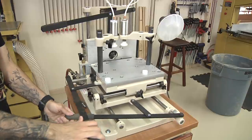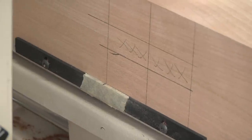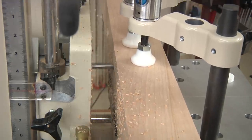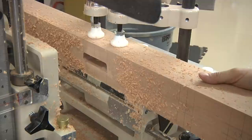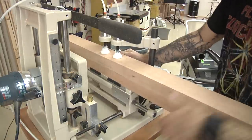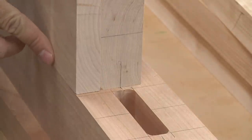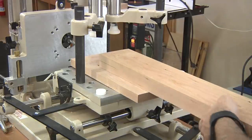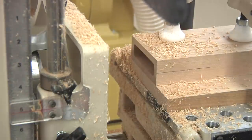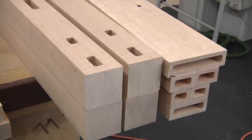Now let's play with the multi-router. The platform slides smoothly in two dimensions while the router bit remains stationary — a deceptively simple design. After laying out my mortises, all I need to do is line up the center line with the center line on the multi-router, clamp the work to the table, set my stops, and route away. With these settings locked in, I'll make the same mortise where appropriate in the other legs. To make the adjoining mortise on the rail piece, I could reset the vertical position of the router, or I can simply mill up a piece of scrap that will raise the height of the rails on the platform. With the scrap piece in place, I can line everything up while also using a roller stand for extra support. And just like that, we have two perfectly matched mortises. The rest of the mortises are cut the same way, adjusting the stops as needed. This is pretty much as close as you can get to repeatable mortise perfection.